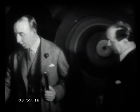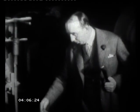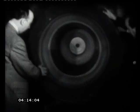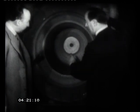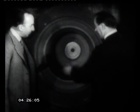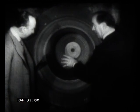Right, well, when this is complete, it has over it a cope, a cover over it, which leaves a space the exact thickness of the bell, so that when the metal is poured in, it forms the bell itself between this and the cope. And we've got a cope here, a finished cope, and I noticed, Paul, that it's a lovely satiny finish. It's much smoother than that. Well, we've polished this with graphite and a few other things. Just as your wife would polish her pans when she's cooking a cake, she'd grease it all over so the cake wouldn't stick. Well, we polish this with graphite so that the metal won't stick.